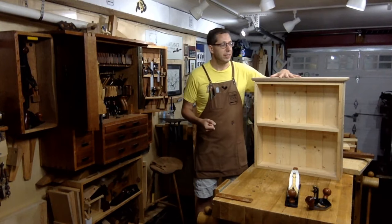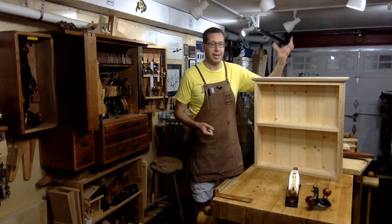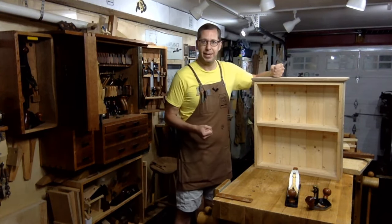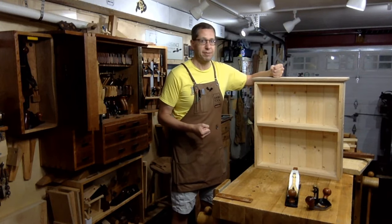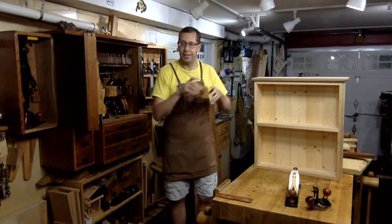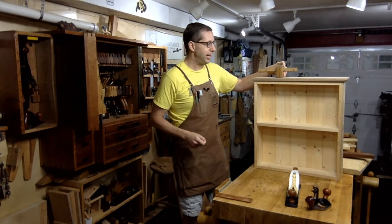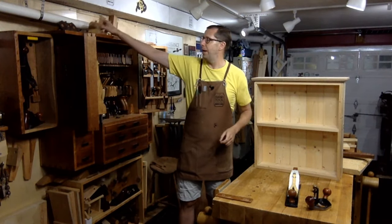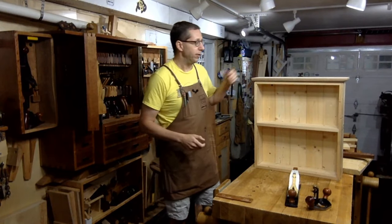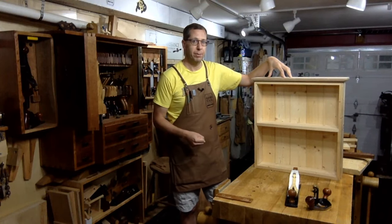You could call this decorative shelf a functional surface in the fact that I'm going to set a knickknack on it or something like that. But a big brass candlestick would require a very, very out of flat surface for it not to rest appropriately. Moreover, say that candlestick, it's only this little area that needs to be flat that the candlestick references off of. So right away, the question of is it flat enough becomes a totally different story here. The flatness of this particular surface is entirely unimportant.